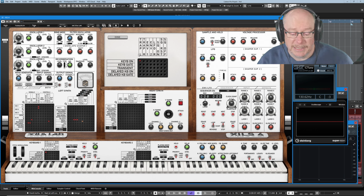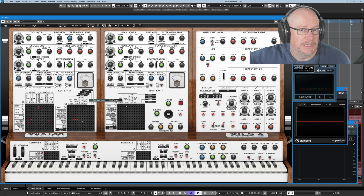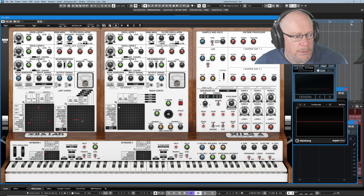And what's actually happening is when you press a key on the keyboard, our keyboard on trigger is sending that signal to a thing called an envelope shaper, and that ultimately is going to be what generates the sound. I'm going to talk a little bit more about trapezoids later, but just for now, let's say we're done with that section. We've figured out how to generate a trigger off the keyboard and make it do something somewhere else in the synthesizer. We'll worry about what later.